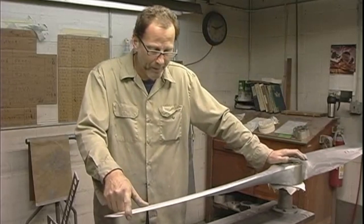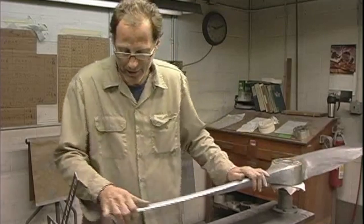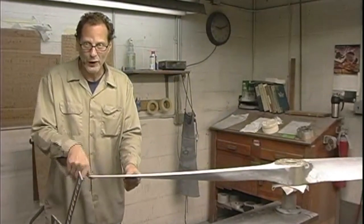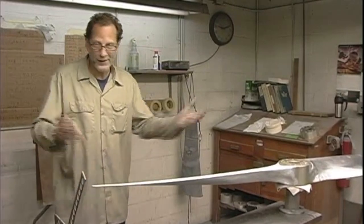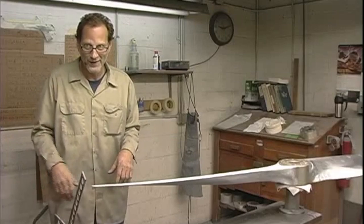Now, if there's a lot of vibration, they land right away. And I've seen the engineers come out with an electric grinder and just make an elliptical tip from a square one. They jump back in the airplane, take off, and see what that does. If that didn't do anything, then they land the airplane, take the prop off, go back to the engineering room, and start all over again.